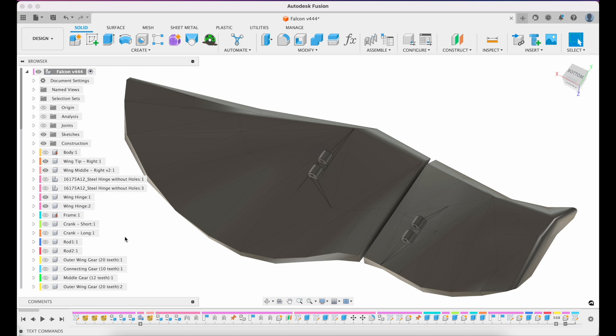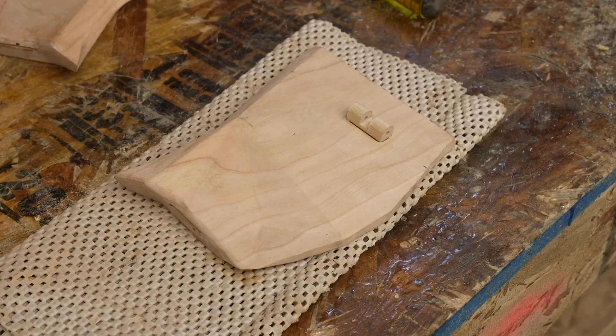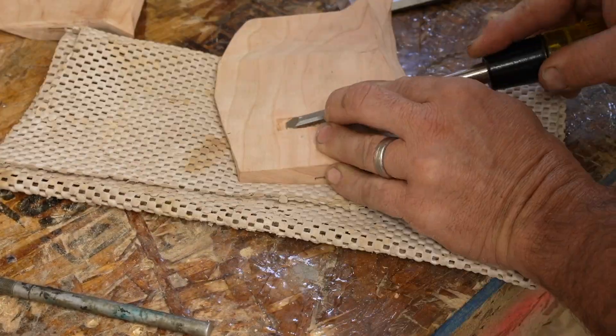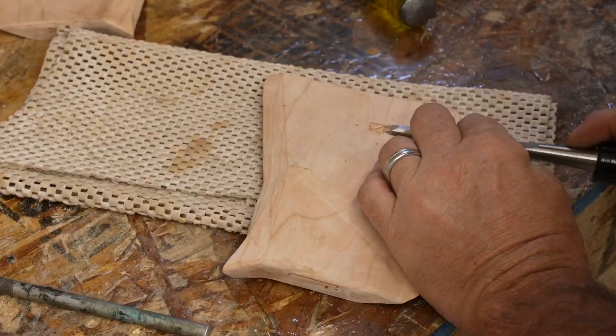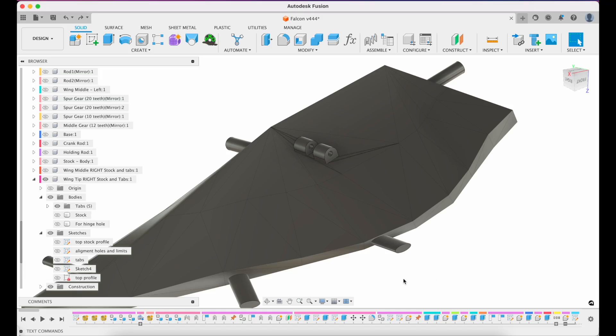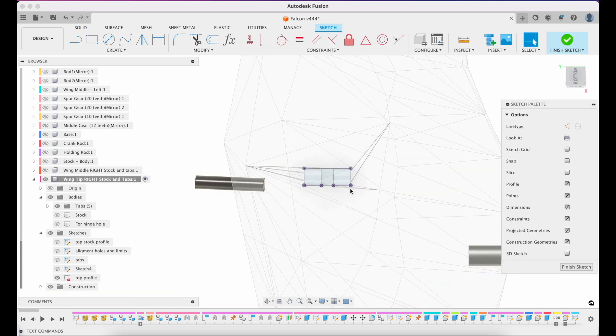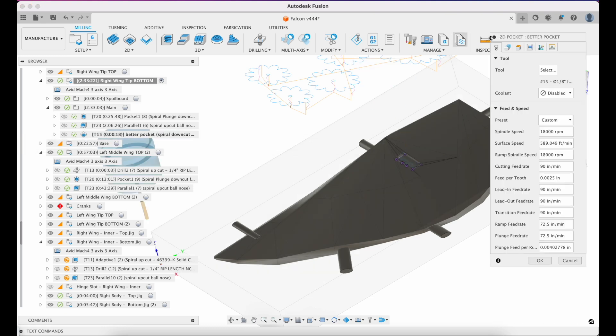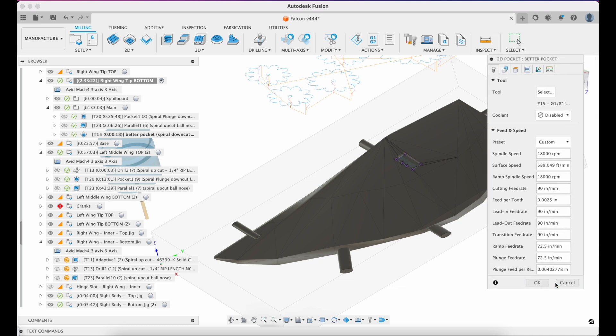The way I planned to attach the wing to the rods or control arms was to use some little wooden hinges. On the first wing I cut out, I had the indentation for the hinge in the wing and just let it machine out with a quarter-inch ball nose, but this left a not very desirable slot and I had to use a chisel to square it out. The way I solved this was to create a sketch on my stock piece inside Fusion 360, project that shape down, and have a perfect rectangle machined out. I could then create a better toolpath in Fusion 360 — a 2D pocket with a smaller bit, in this case a one-eighth-inch spiral down-cut bit — to create that little pocket with just a little bit of round corners that had to be squared up.